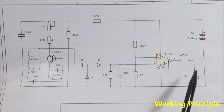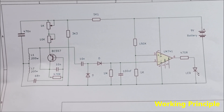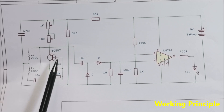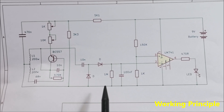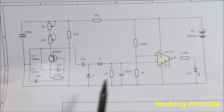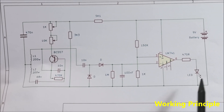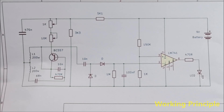And in that moment, the LED goes out. Now, as the metal object approaches the coil, the amplitude of the sinusoidal signal decreases, and so does the voltage at pin 2. When this voltage becomes lower than that at pin 3, a voltage appears at output pin 6 and the LED lights up, which actually indicates the presence of metal near the coils.